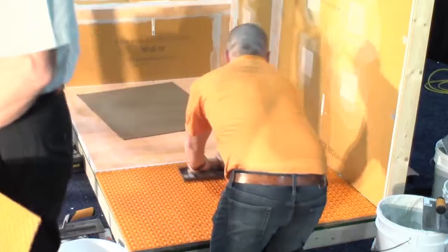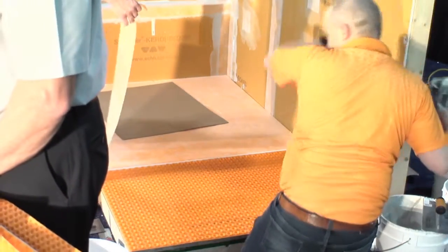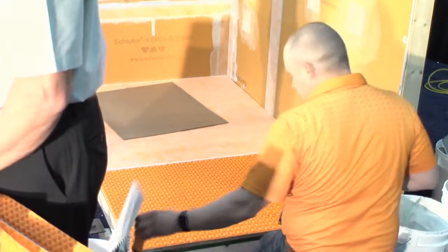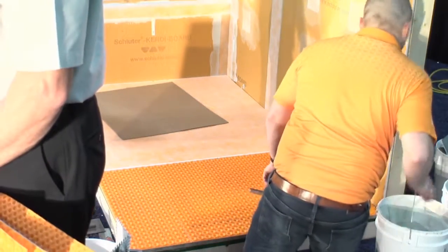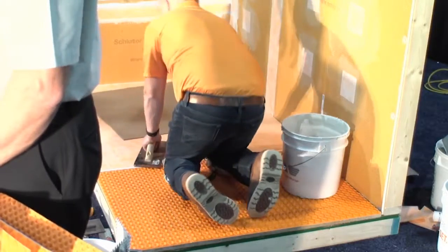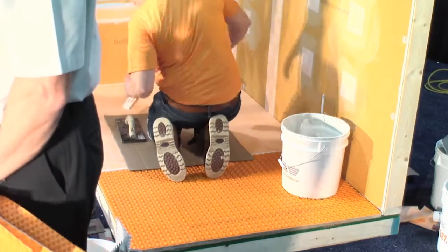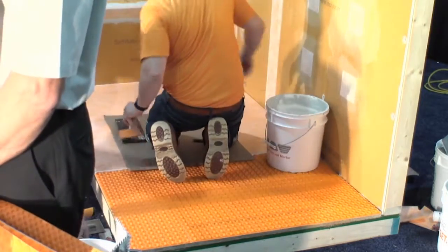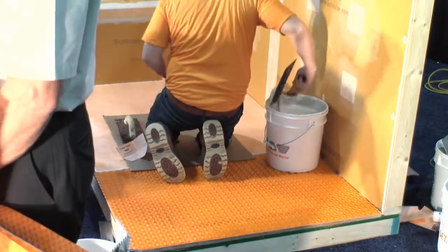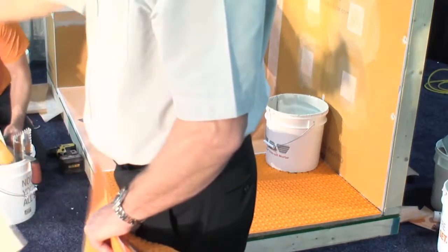It does it because you're getting a mechanical fastening of DITRA or tile via the thin set to the DITRA. Each one of these squares you're looking at is cut back underneath like a dovetail. So when the thin set fills that up, takes that shape and gets hard, it grabs a hold of that cut back cavity, but it's mechanical fastening only. And it supports the tile under load by the support capability of the thin set when it cures out. If you look on the back side, we put a spun polypropylene fleece on the back, which is highly absorbent and absorbs up the thin set that is placed in and rolled or pushed down in. That's what the guys did right up here with our DITRA heat.